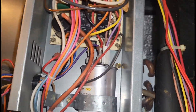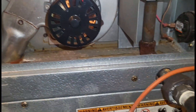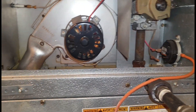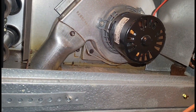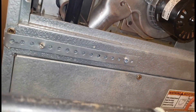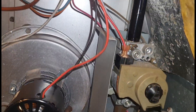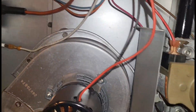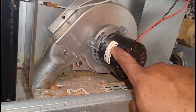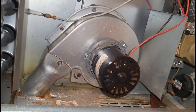I got my power off. The common and everything was connected. Yeah, it's getting power — looks like the winding is probably just shorted out. This thing isn't even hot, which is weird. Alright, let me get the model and serial number and find out who has this motor in stock.